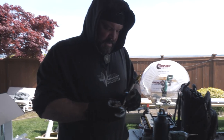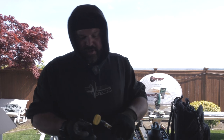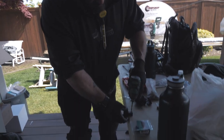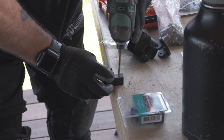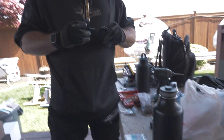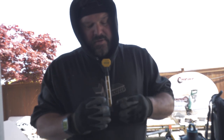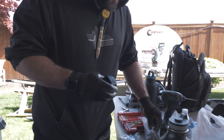I made a little jig just to mark — instead of trying to take a tape measure and mark a half inch out from the end of the bracket, which is kind of a pain, I went ahead and just cut a half-inch piece of material so I could easily make my marks. These are called a universal angle bracket and they're designed to either swivel this way or swivel this way, depending on if you need them for an angle on a deck or angle on stairs. This time I'm using it for an angle on a deck.